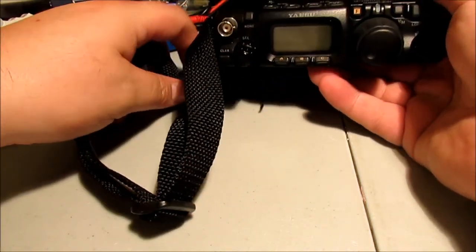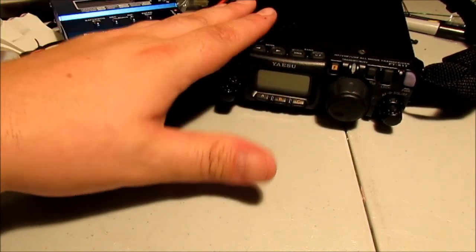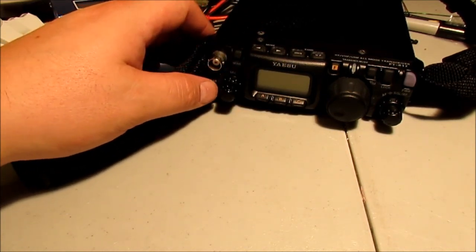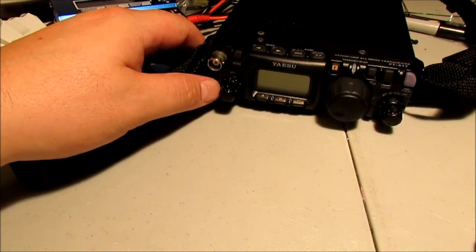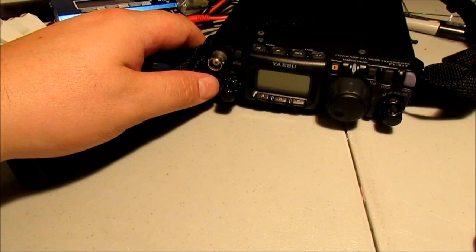That's something I think a lot of amateurs should try to get some skill in, is SMD soldering, because not only will it help you with anything wrong with radios that are using SMD components, which is pretty much everything made in the last 20 years, it will increase your soldering skills overall. Some people for some reason still think you crank the soldering iron up to 900 degrees, and then you wonder why all the plastic around whatever you're trying to solder is melted. Anyway, this devolved into kind of a little rant. I will leave it here for now.